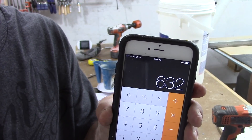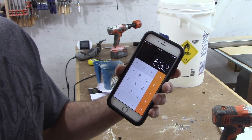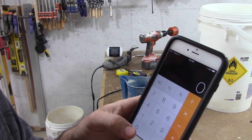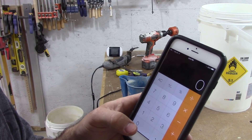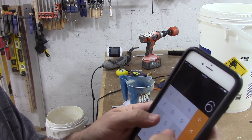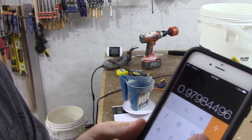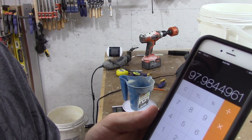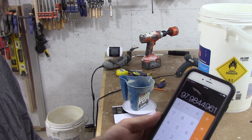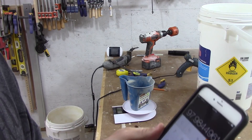Six thirty-two. I'd have to go back and check the camera to see what it was before — I think it was 639 — but I'll double check. So I just went back and checked the tape and it was actually 645. So we had 632 afterwards: divide 632 by 645 and you get 0.979, times 100 that's 97.98% efficient. You can definitely make these things more efficient than that, no question, but for 20 minutes worth of work, I'm pretty happy with that.